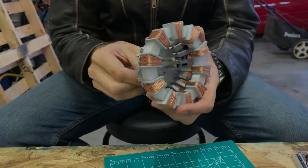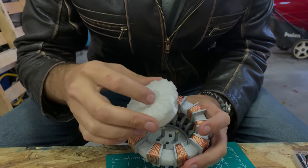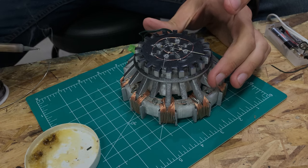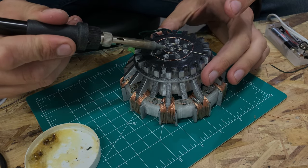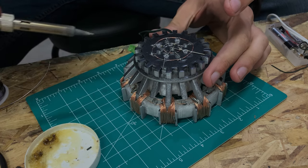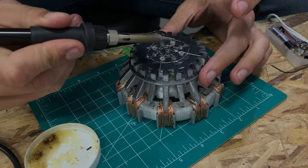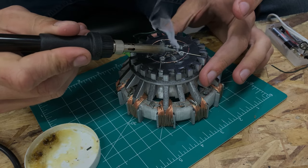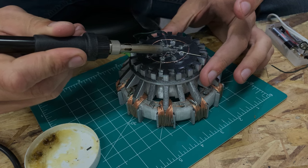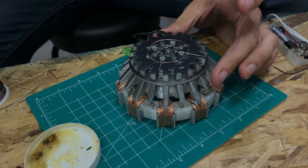For the main crystal, I used wooden dowels to align the LED holes to the support cage when I glued them together. 5 blue LEDs and 4 white ones were desoldered from the remaining dollar store strips, then placed every other. Same as above, wire all the positive together and then wire all the negative together in the 2 separate circles like we did before, with the bare copper wire on the outside bottom of the support cage.